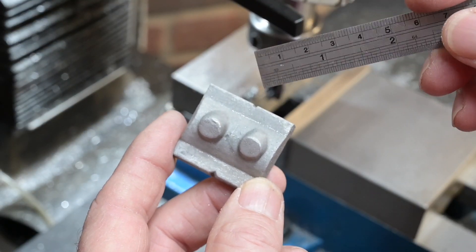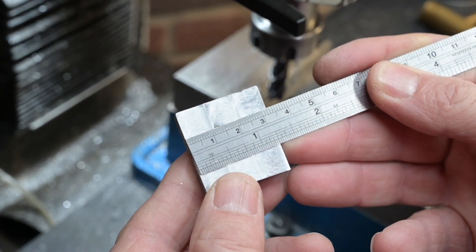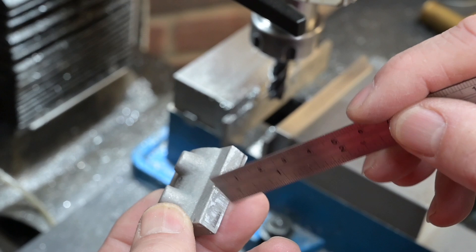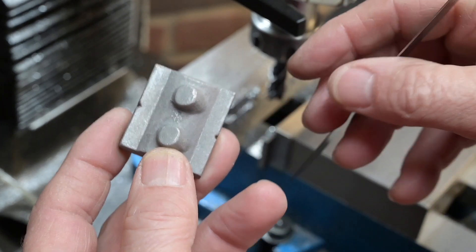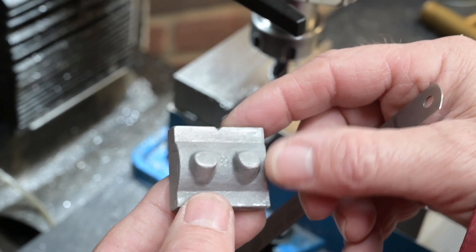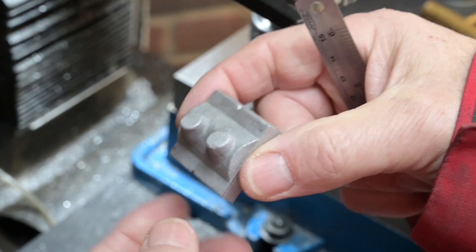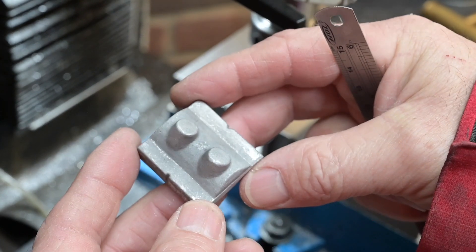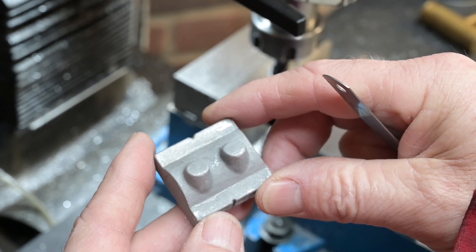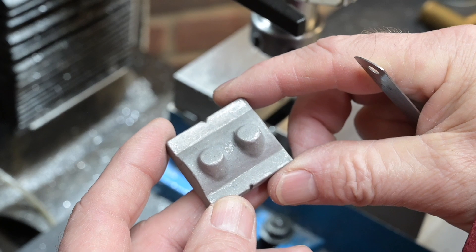First thing I want to do is machine this piece up. Unfortunately it's already down to dimension on that side at an inch and a quarter, which means I can't machine out these casting marks, so I'm pretty stuck with them — I might be able to fill them in later on if they bother me before I paint it. Anyway, what I'm going to do is get this piece down to dimension and then split it so I've then got the two bearing caps. First job: just square this up a little bit where I've got enough room left to mill some off, and then drill out the holes so I can fix it down to the base plate.